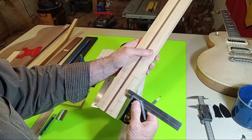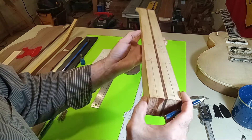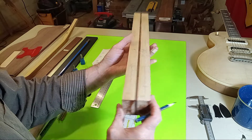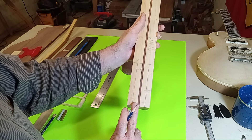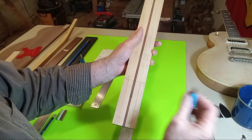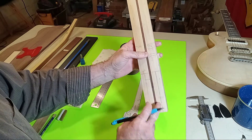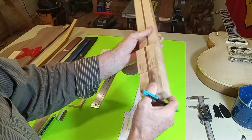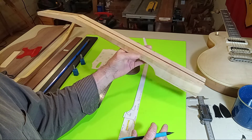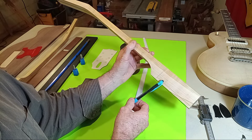I work from the center lines because I knew my center line was precision straight. So I measured over five-eighths of an inch — since one and one-quarter divided by two is five-eighths — using a sharp mechanical pencil, not a number-two pencil. I made a mark there, connected the dots with a straight edge, and drew my tenon. I could transfer it and draw it to the back as well, just to get these lines in place so I can determine how to start machining the neck.